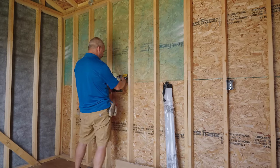Again, let me show you this way. See, there's my measuring tool, so it's the width of the tool. And then I put a bend on it, bring it all the way around so it's easy to wrap my screws. Okay? Here we go. Power in to the bottom. Push that wire right in against that plastic, and then you can close the gap. All right? Hold it nice and tight with your fingers and drive it home. Then we'll pick the other power supply. That is part of our connection to the next plug.